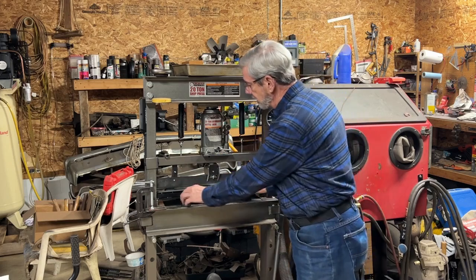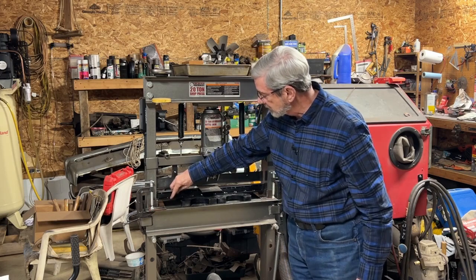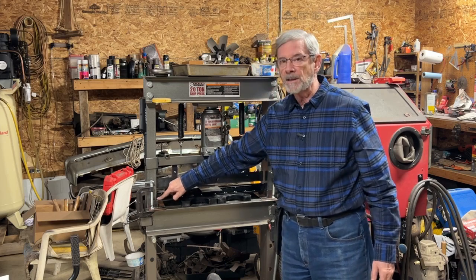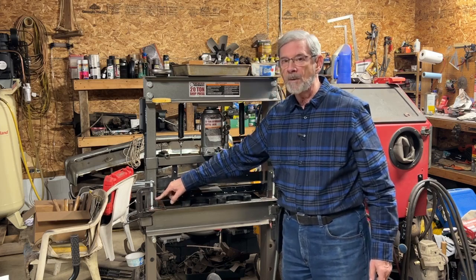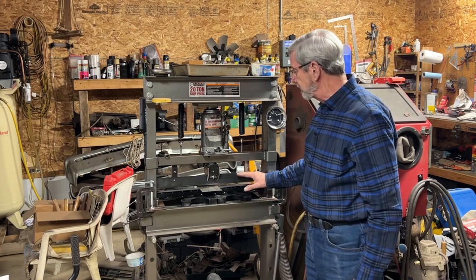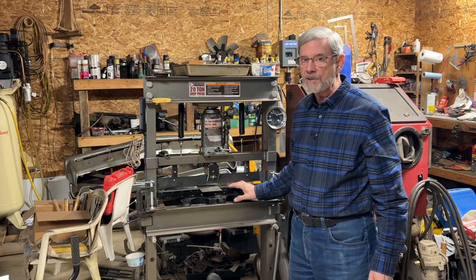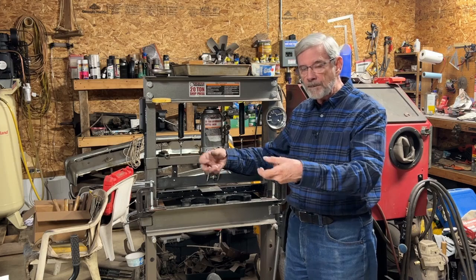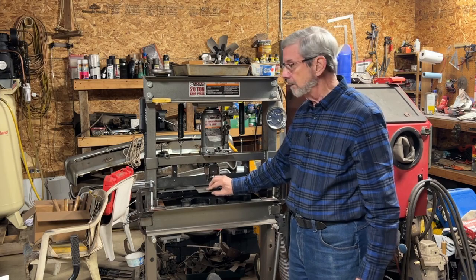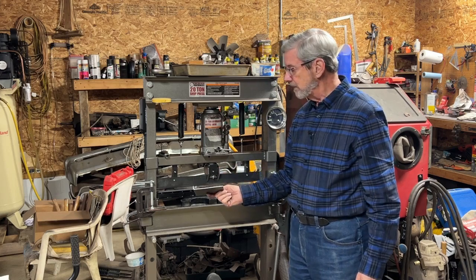So even when these 1 inch spacers are pushed out, they're going to come out to about here anyways, and that part's flat. So then I added a little weld on the end so that it would be flat all the way out to my supports on the end. So after doing that, I tested the 16 gauge pieces that had not completely bent up on the ends, put that in here, and it pretty much straightened them right out. They're completely square now.